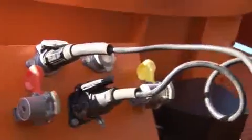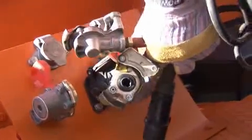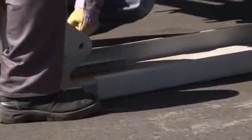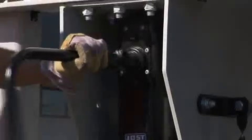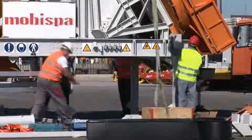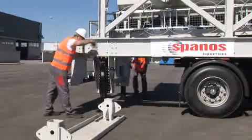Disengage from the tractor and support the machine on its adjustable front legs, after first placing the special shoes and support base in the following order: remove movable shoes, place fixed shoes, assemble pins and lock in place. By means of the adjustable front legs, elevate the machine while giving it a backward slant. Elevate the machine with the adjustable rear legs and temporarily insert the metal bracket in place.